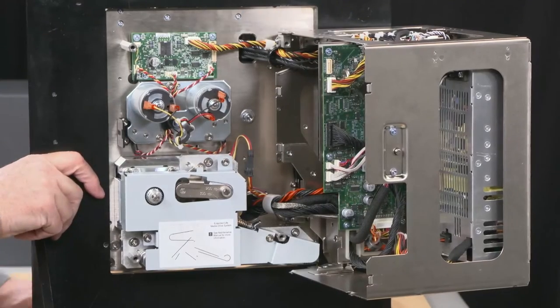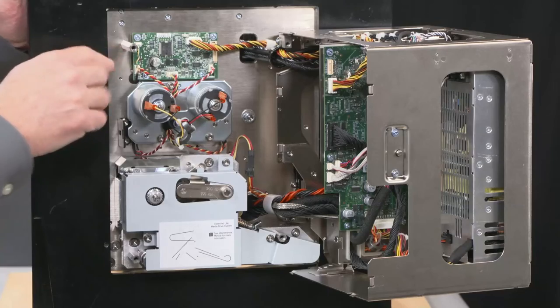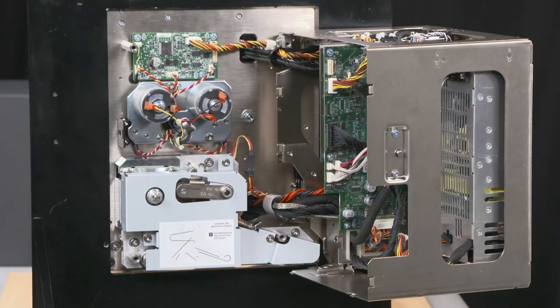In the back here, you have your ribbon system and ribbon board. Those have both been located here on the firewall. Where the ZE500 was a quantum leap in serviceability, what we've done with the 511 and 521 has really finely honed that edge. We've developed these modules that allow you to troubleshoot down to a module and quickly change it, because the name of the game in automation is to stay up and running — it's all about uptime.